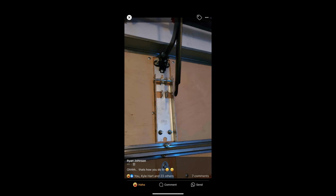So I guess this person doesn't like those fancy door brackets, because it looks like the way it's done is he took one of those nice reinforcement brackets and cut the bottom of it off, because you're not supposed to take out those top screws to slip it under the strut. That's not at all how you're supposed to do that. And then you just screw that onto the door, and then that bracket's really not serving any purpose, because this guy decided he wanted to use the LiftMaster bracket and just screw that right to the top of the door.